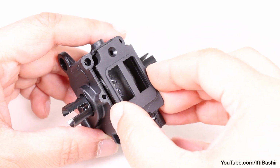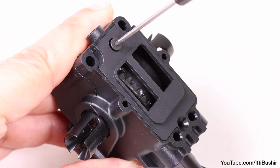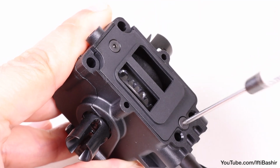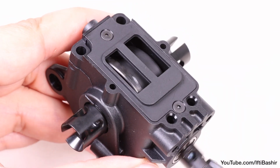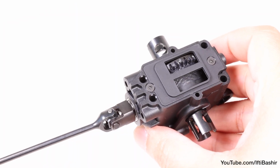We can then proceed to seal up the gearbox by placing the final plastic cover on the bottom and securing into place using 2 6mm flathead screws, again taking care not to over tighten and strip any threads. Gearbox now sealed, although still open from the bottom, so take care with that grease. This will be covered when installed on the chassis later.